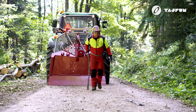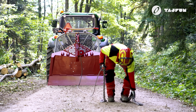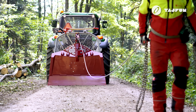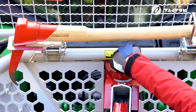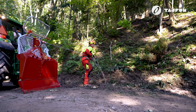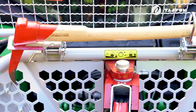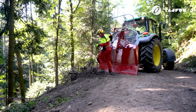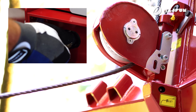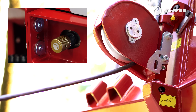Feeding activates by the function activation and by the wire rope being pulled. In case rope pulling stops, feeding also stops, preventing uncontrolled unwinding of the wire rope — only the necessary amount of wire rope unwinds. The feeding activation force is adjustable depending on whether the wire rope needs to be pulled up or down, and the feeding speed may also be adjusted continuously.